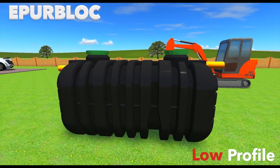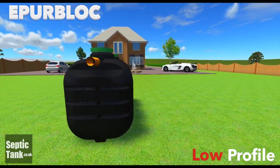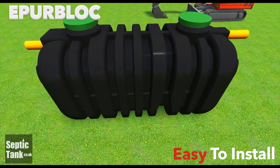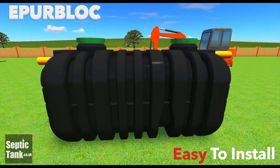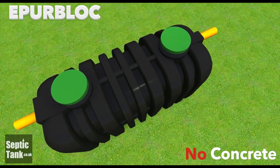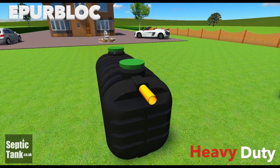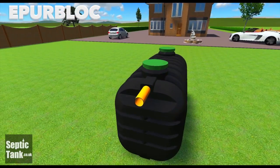The EpiBlock is the best-selling septic tank in Europe and it's not hard to see why. It's low profile and shallow in size. It's very easy to install — it's been created for the DIY market so typically it takes 2-3 hours to install from start to finish. It requires no concreting so you can install it with sand or 20-30mm granular backfill. It's heavy duty in construction yet light, so unlike fibreglass it won't buckle or break.